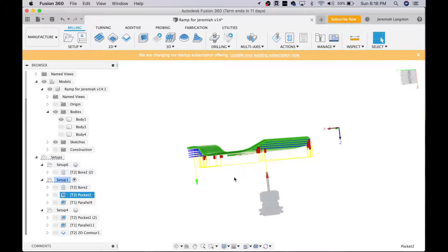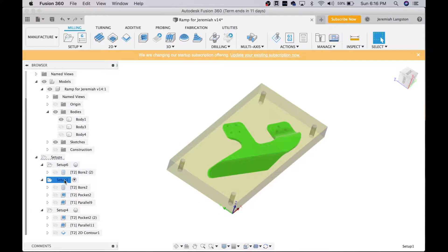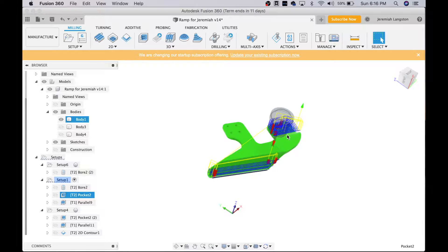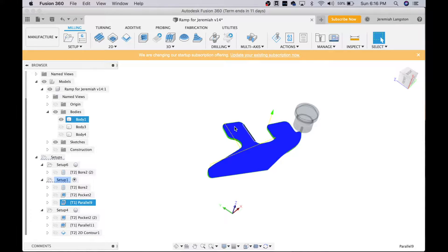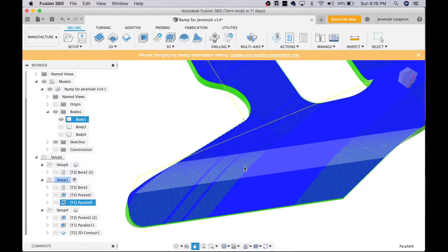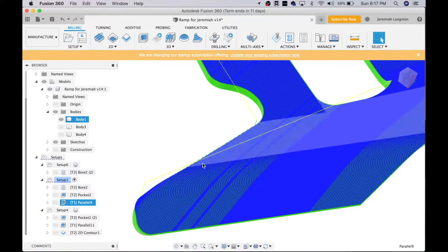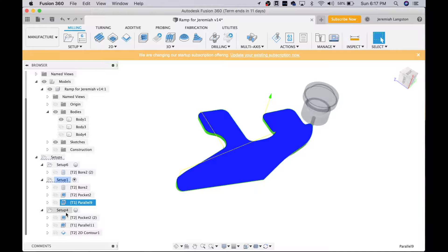As long as you use the mechanical accuracy of your machine to establish the holes in the table and the holes in the blank, they'll press together and as long as you have enough excess material it'll cut around it. This is my starting material — this transparent box. The bottom left-hand forward corner: Z-axis is going up, X-axis is the short axis on my table, Y-axis is the long axis. I basically come in and do this milling operation to cut these ramps — just a rough pass — then I come in and do a really fine finishing pass. I remove 0.1 inches of material with a ball end mill and I use a really tight stepover so the surface finish comes out great — the passes are about 0.015 inches apart.